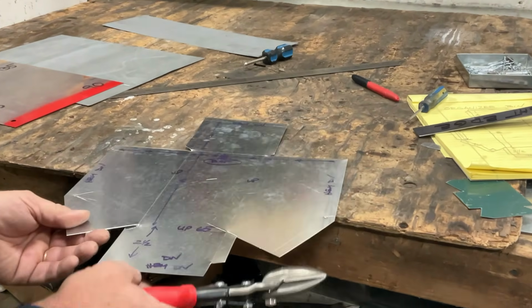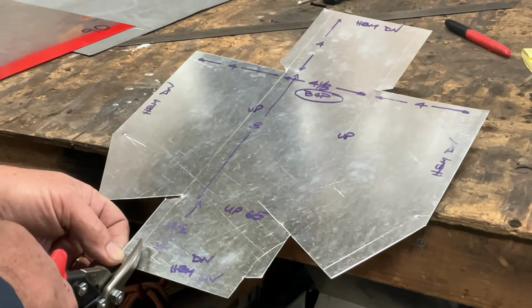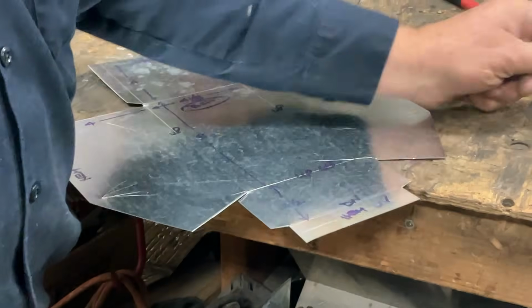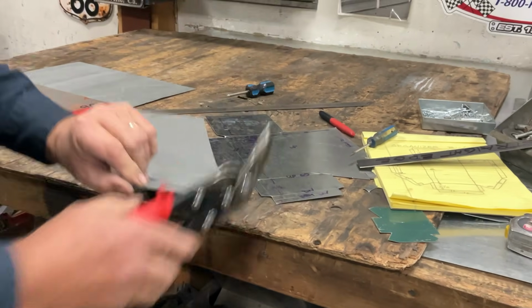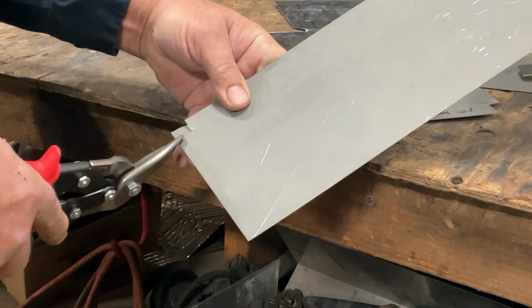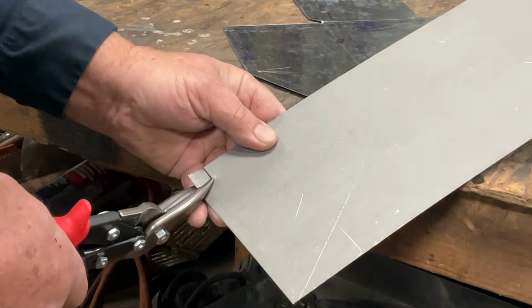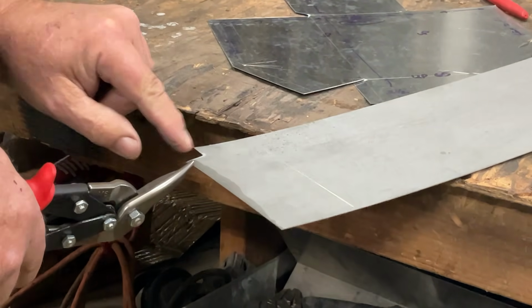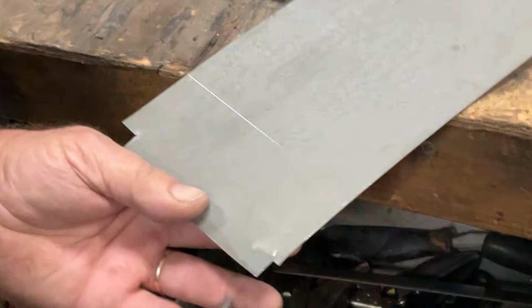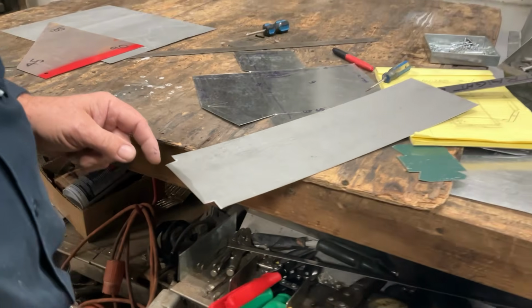Just in case you didn't watch before, here's what we're going to do. We're going to do this wrong. Doing it wrong. Oh, no, wait. Couldn't help myself. Did it right. All right. Since I already promised you doing one wrong, let's do one wrong. Here's notching this thing wrong. So I've just notched this, and now, since I can see this part, it can come toward my eyes. Did you see how, since I could see it, it could come to me? All right. Let's do it right. We're going to go here, and look, my snips are covering the drop, so when it comes off, it's going to go down. Wrong? Right.